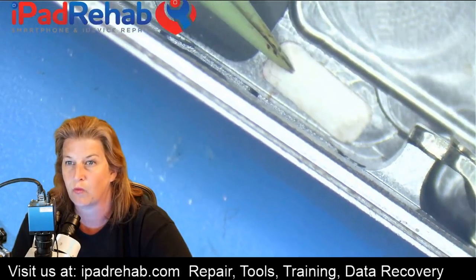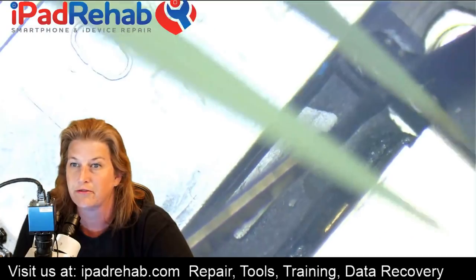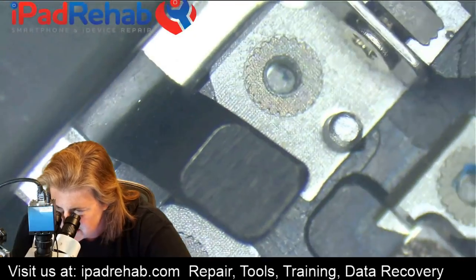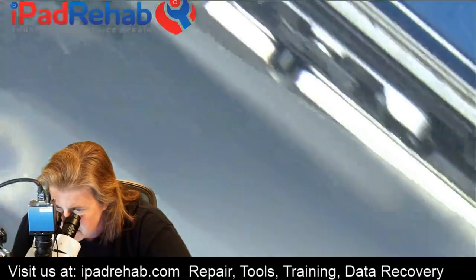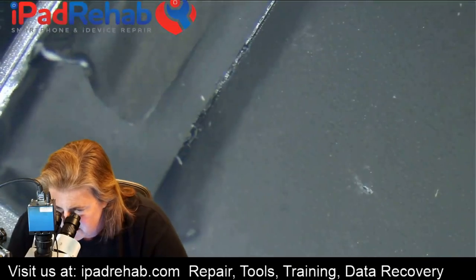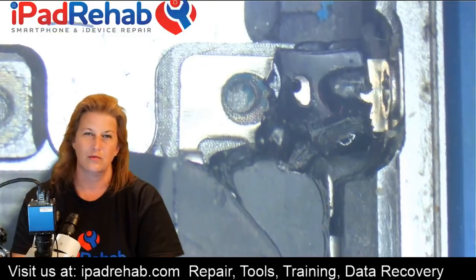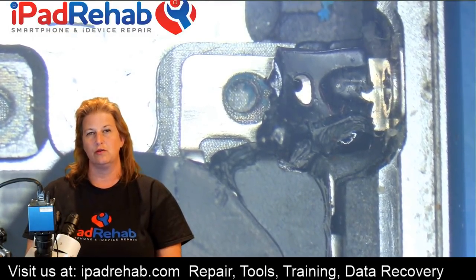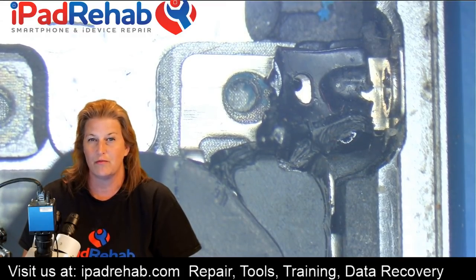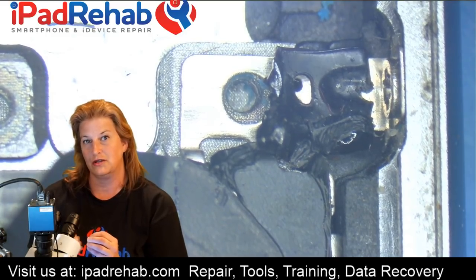The charge port flex seems okay. The battery — I have no way to know if it's the native battery; it would be typical for a shop to change it during troubleshooting. There's no sign of water entry — the water damage sticker is white. And then there's really horribly damaged rear camera. Remember on our 5C experiment the front camera was really horribly damaged but the other camera was not — again going with this very severe but very focal damage.